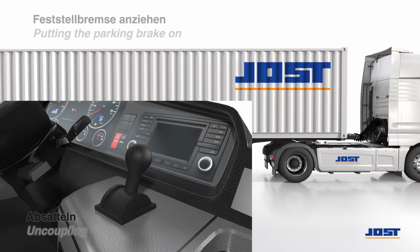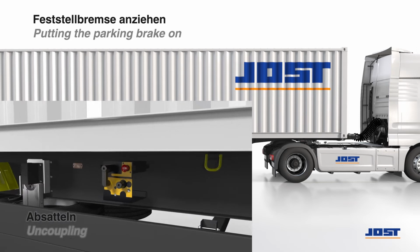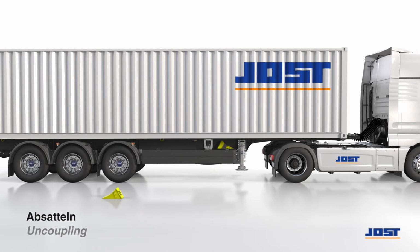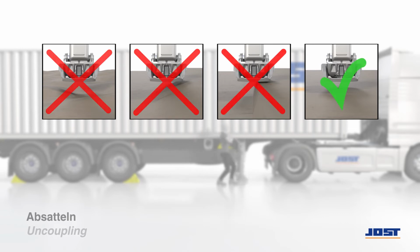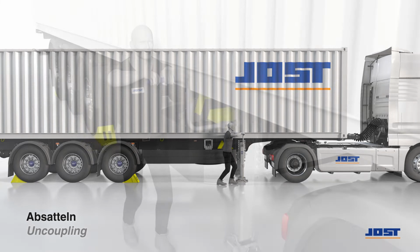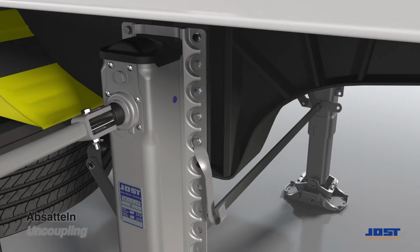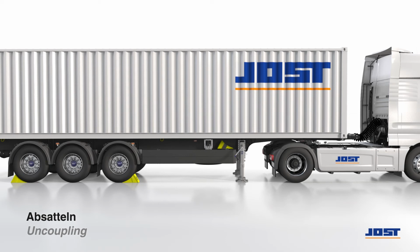For uncoupling, park the unit on solid, even ground. Apply the trailer brake. Engage high gear and lower the landing gear. Change to low gear before the feet touch the ground, ensuring a smooth changeover. Uncoupling can be started as soon as an air gap is visible between the fifth wheel and the skid plate. After completion, the crank handle has to be put back into the parking hook.